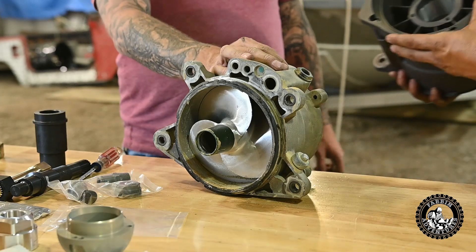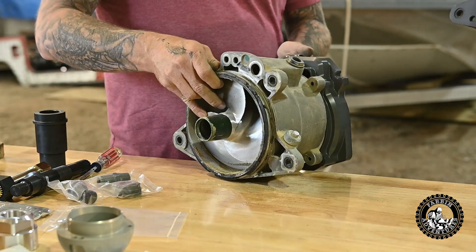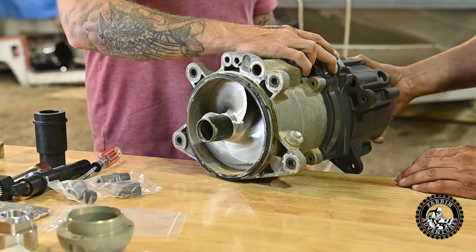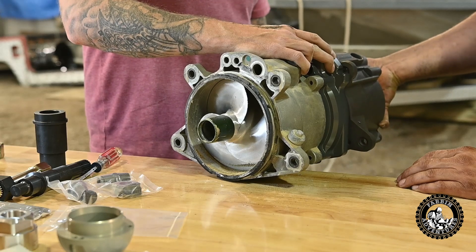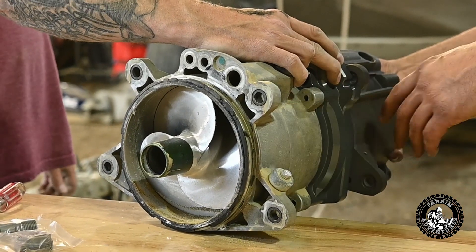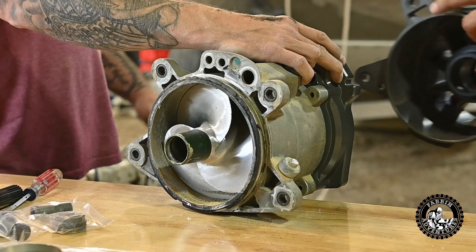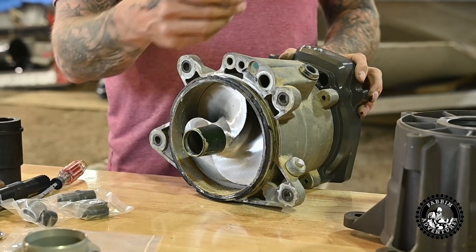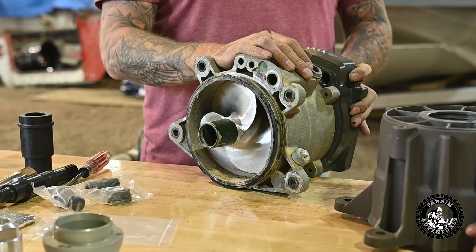Then this piece gets attached on here like this, and that one's on there — something like that. That's roughly what it should look like when we're done. So you're going to have two impellers: one bigger impeller here and a smaller impeller. The theory behind it is you can suck more water with the bigger impeller — more volume — and the smaller one compresses it more, giving you more thrust.